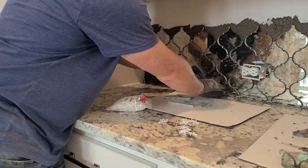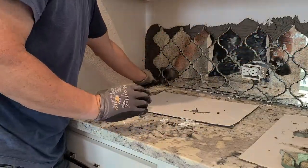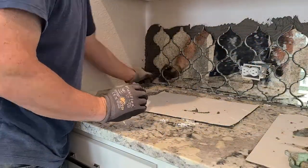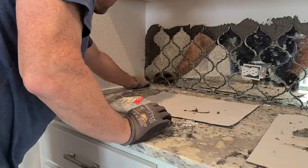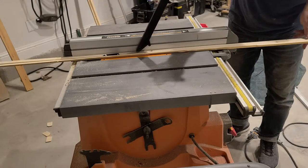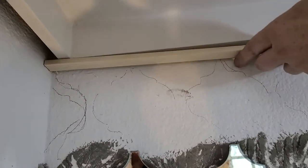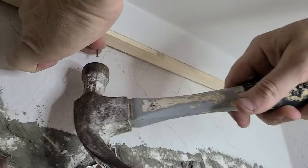In terms of height, the wall is just about a half inch too high to have a convenient number of full tiles. Given how hard the tile is to cut, instead of making the tile fit the space, I tried to make the space fit the tile. So I cut a thin strip of wood and nailed that up under the cabinet — it's really not visible when you're walking by, and it helps space the tile just right.